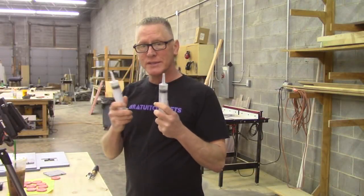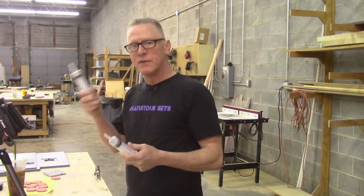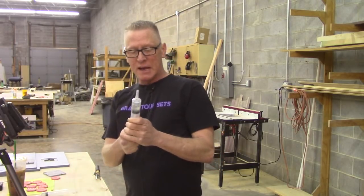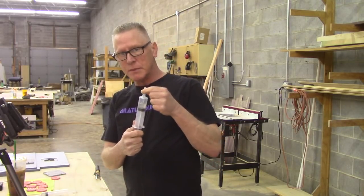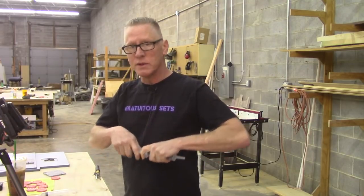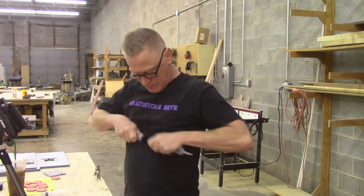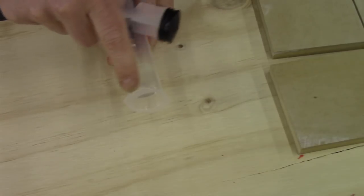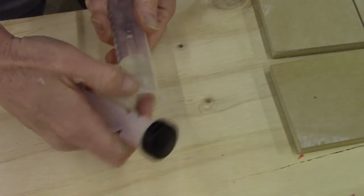Okay, we're gonna demold these guys. They're all done. And I'm doing 9 total. So I'm doing several iterations of them because we have 9 molds to make. I pull this guy back and it may or may not release from the tip. In this case, they are releasing from the tip, but they won't release from the entire syringe. There's a neck at the back of the syringe in this area here, and it won't go beyond that point.